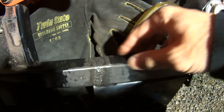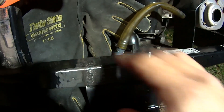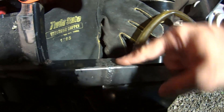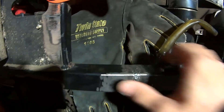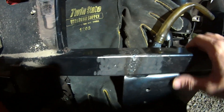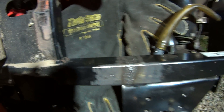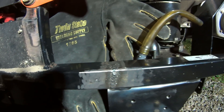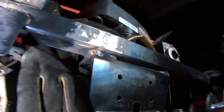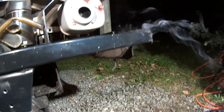There's a little bit of spatter, which means I've got my wire feed just a little bit high. That's okay because I kind of want to push the puddle in when I go upside down. I've welded the top and the side after getting some alignment tacks and using my clamp to wrestle it around. I've got the two visible sides done. Normally I like to do the hard thing first, but I'm trying to make the hard thing as easy as possible by preheating the other two sides of this tubing so I can get as good a weld as possible.